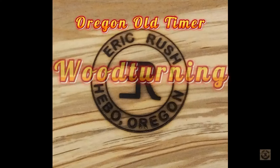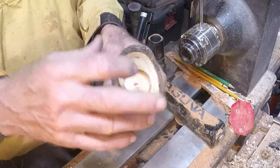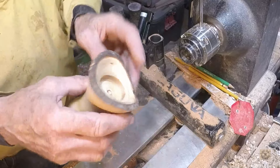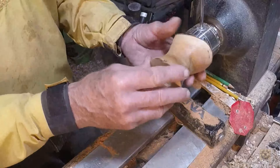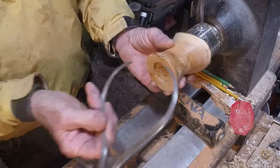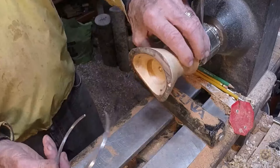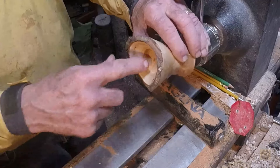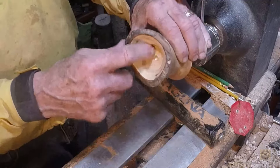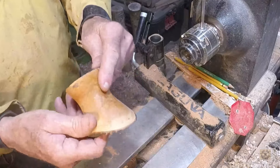I think that's the same — yeah, inch and a half. But this time I'm going to drill a hole for the top on the drill press, but not this deep. Put it in here, turn the bottom to 72 millimeters, insert that in a chuck, and do this in. I'll use a straight end scraper instead of the Forstner bit so I won't have that brad-point hole in the bottom. That'll be a whole lot nicer.